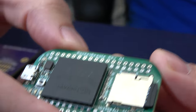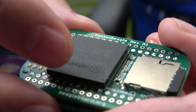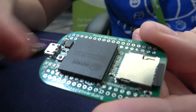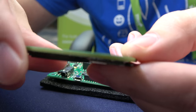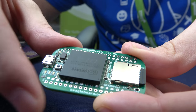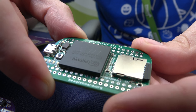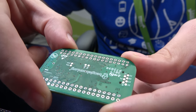These are actually on sale, launching last week at Maker Faire New York — the Pocket Beagle. Octavo went ahead and made the chip even smaller for us. How much smaller? About 60%. This chip has all the same features as the bigger chip — actually a little bit more. It has an EEPROM embedded in as well. The board is also single-sided, very simple. The added benefit is that it breaks out a lot of IO on the two headers on the side. The design was done by GHI, but I did do a KiCad conversion so we have both KiCad and Eagle versions. You can download the design files on GitHub and make your own derivatives.